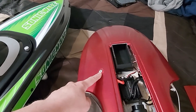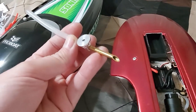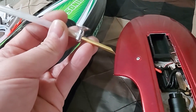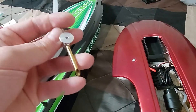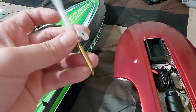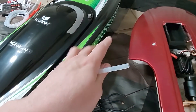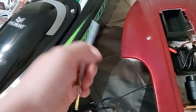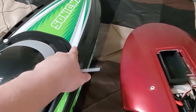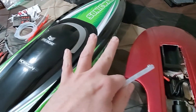The Amazon pickups have a nice angle cut so that when moving through the water, water is forced to shoot straight up into the tube. The tube diameter is also much bigger than the stock stuff, which is just tiny. I'm also going to put the exit on the top of the boat so I can see the water slinging out and confirm the cooling system is working properly.